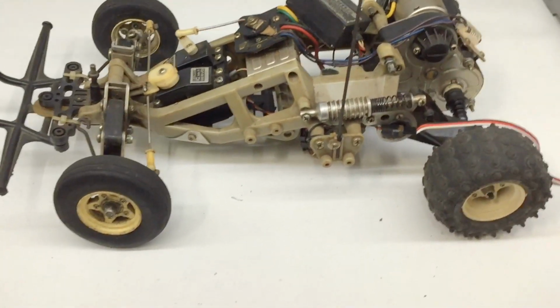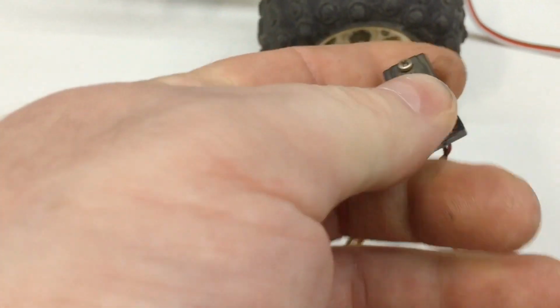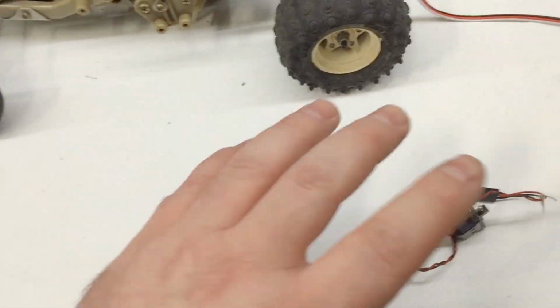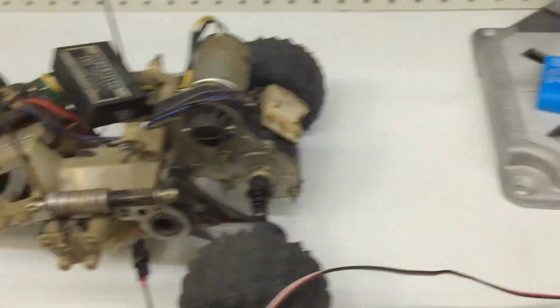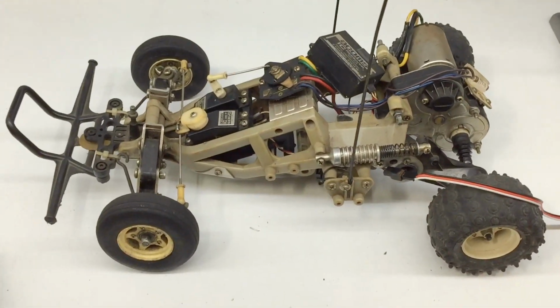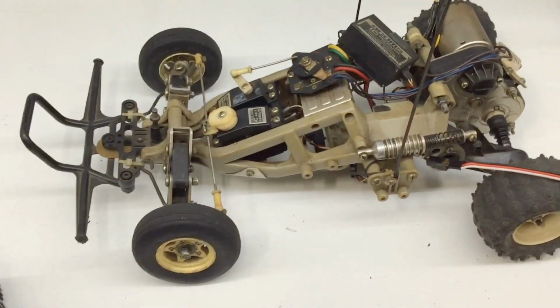Alright, first things first, to find out whether this radio works, and it turns out it does. The switch is very stiff, but when that's plugged in, this is kind of dirty in the contacts and that, but I just thought I'd plug it in, see if it runs. But it won't work with that on, but I've hooked it up to my power supply there. It's only on 6 volts. And the transmitter's turned on. Beautiful. Alrighty, I'll get on with the disassembly, and I'll sort out that battery box and switch later on. But yeah, pretty pumped that works.